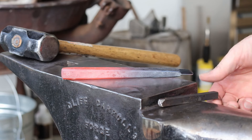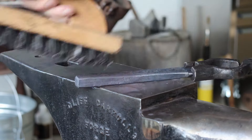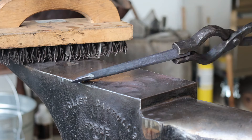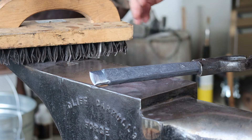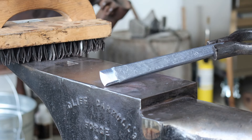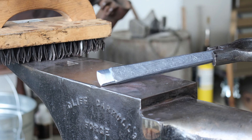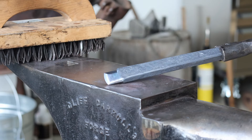I'm just going to put my touch mark in here. Now I'm going to spin this around and heat treat just like I've done with my punches — a quick douse in water after heating up to about a dull orange color. Then I'm going to scrape the tip, watch the colors run, and temper this thing in situ as we go. I'm going to pop this thing back in the forge, let it heat up nice and slow, and start quenching. I'm going to heat up at least half the body of the chisel here to let that heat bleed forward so that I can get a good tempering run out of this.